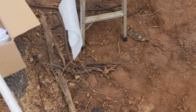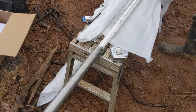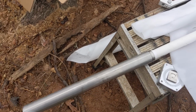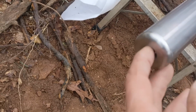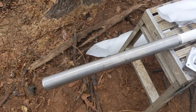I know there's other Simple Pump videos that we've done in the past, but right now with the way things are going on, a lot of people are inquiring about the Simple Pump. So I just thought I'd show you the components for when you put your own in, if you want. This is the piston. This is a 5 gallon a minute piston. It has a check valve in the bottom, and there's a check valve in the piston. It's just a double acting piston in here.